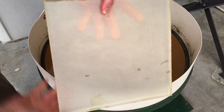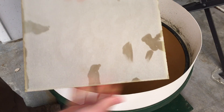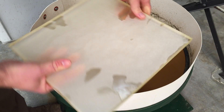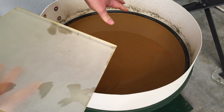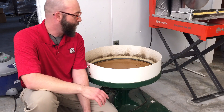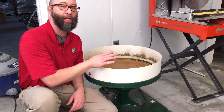You can see that our plate's looking pretty good — it has given you a nice surface and ground it down quite nicely, giving a nice flat surface. And what we'll do next is change our grit in our pan. Now that we've finished our first grind in our Reciprolap, you can see it's pretty messy, and this is pretty typical of a Reciprolap.